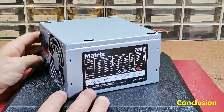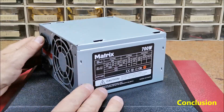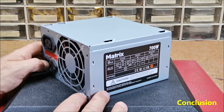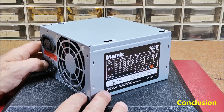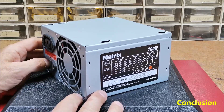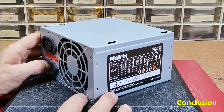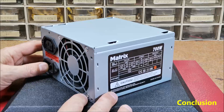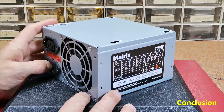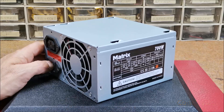And finally a short conclusion. I made this device as a basis for future projects related to high voltage because it is compact, easy to make, galvanically isolated from the mains, and stable during long-term operation. Even though it looks simple, this project should be done very carefully. During testing I damaged two power supplies — one due to overload and another due to carelessness. After any modification we should always first assemble the power supply and then test it, for security reasons. In each test we first start with the largest number of turns on the primary of the high voltage transformer and then gradually reduce.